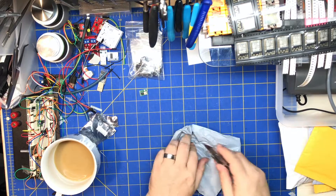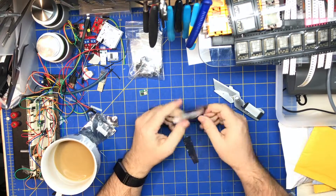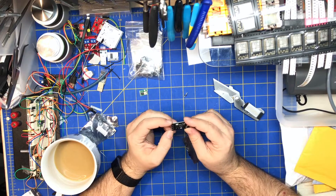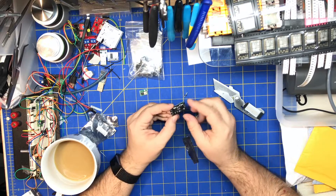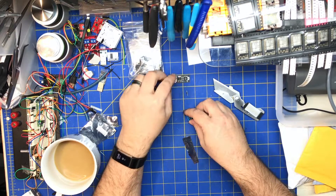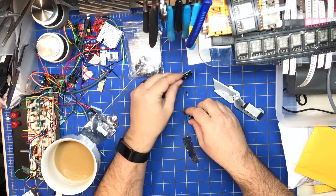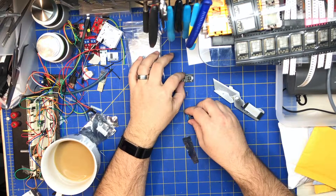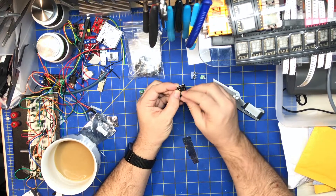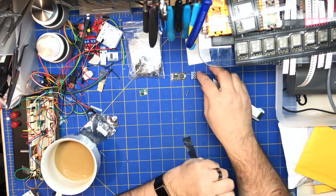Next, MOSFET MOS tube — it's a MOSFET module. Another MOSFET module. I've got some of these, they have three different kinds. They're isolated, and they're all the same — they just have different MOSFETs on there. I thought these were really nice small modules. The only difference is they have like up to 100 amp, which I highly doubt is real. But they're pretty nice modules, cheap, and you can use different sized terminals. There's an input and output on the other side. Got a bunch of those — I didn't test them yet.